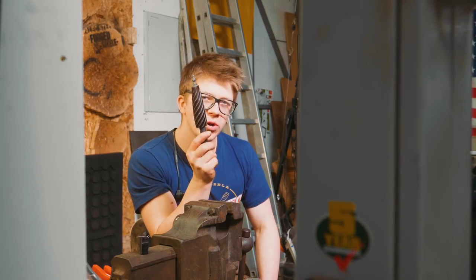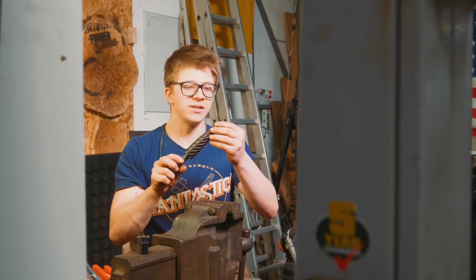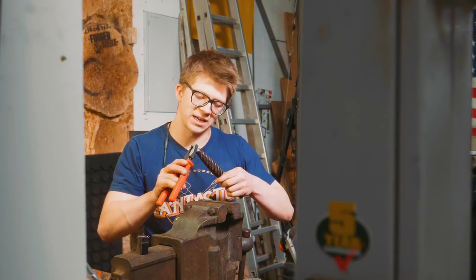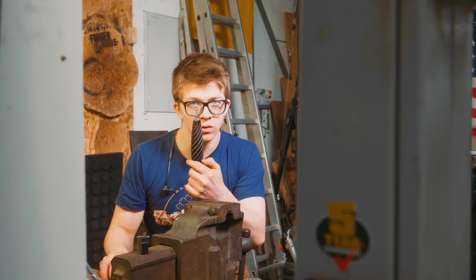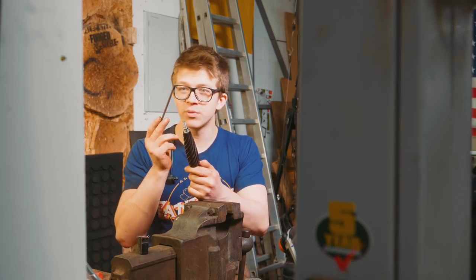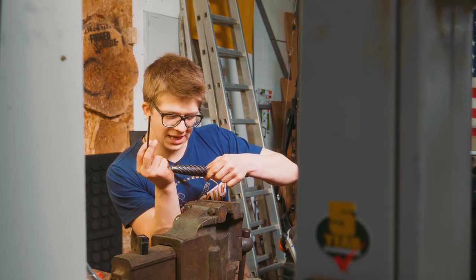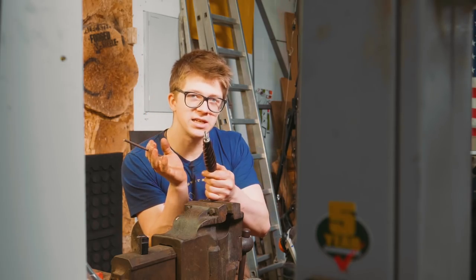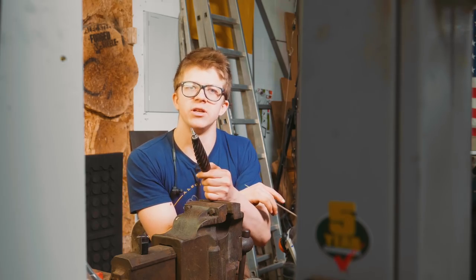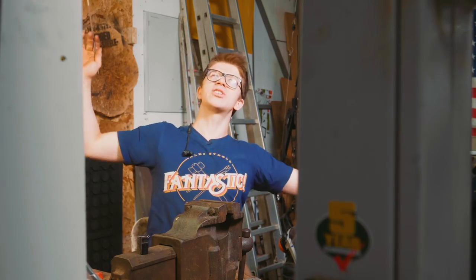And now, I don't want to do the wire inlay and then have to polish the flutes. So the next step is indeed remounting our handle onto our little spigot here, giving it the old tighten so that it doesn't move. And we're gonna take the same diameter files that we used. We're gonna wrap sandpaper just once around it, and we are gonna go probably from 180 grit all the way up to maybe 1,000 grit in every single flute. This is gonna take a while, but ladies and gentlemen, let's roll the time lapse.